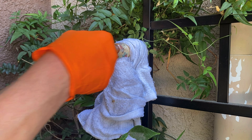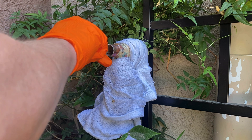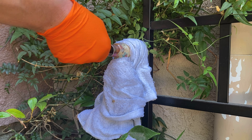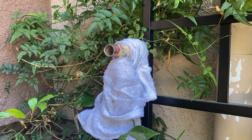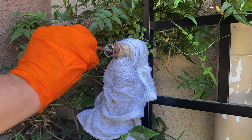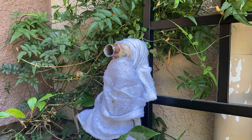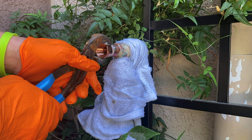It really means a lot for a fitting like this to be seated all the way in. This is right at the front of the home right after the pressure regulator, so there's always going to be a lot of pressure on this fitting. Because we're using a three-quarter FIP by three-quarter MIP hose bib it will be sticking out further than a regular sweat hose bib, so every little bit of space counts. Now the fitting fits all the way in and seats perfectly. We're going to hit it with Ever Flux — I like to flux both the fitting and the pipe. Some guys only do one or the other, but I always do both.